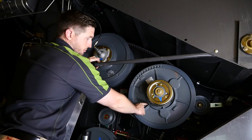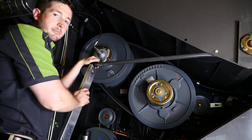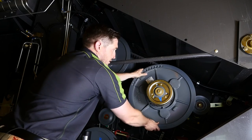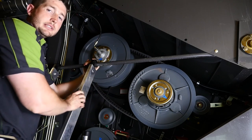Now you can see that we've removed our pusher bolts, but our belt is still loose. To prevent damage to the belt, it's important that we go to the driven pulley and rock it back and forth, or turn the drive system until the belt tightens up on the pulley.